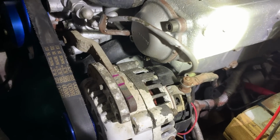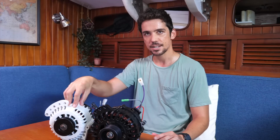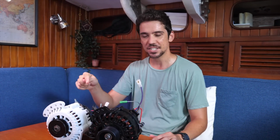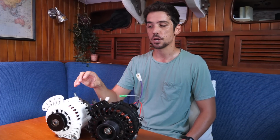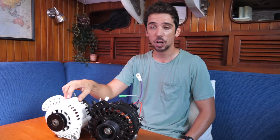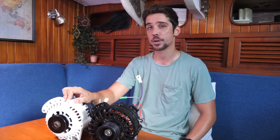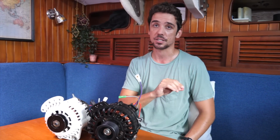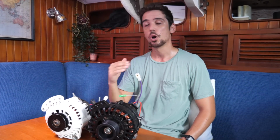The other thing about powder coating is it keeps the heat in. It doesn't conduct heat very well. And if the heat comes from within, you've insulated the heat in. Even with a serpentine belt, it just got so hot that it could never put out even close to 100 amp. About the best we would ever get is maybe 80 for a very brief period of time, and then the charge acceptance rate of the batteries would knock that down, or the heat.